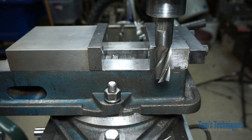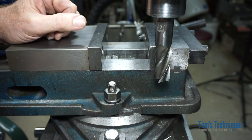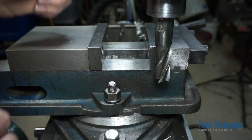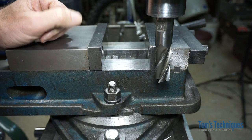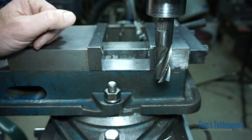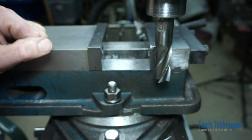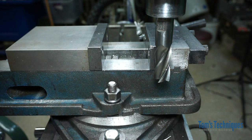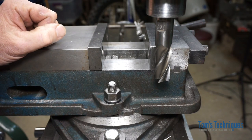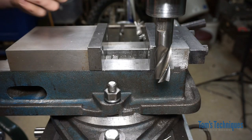Before we get started, let's talk about my setup. I'm using a seven-eighths diameter four-flute end mill, double end. As you can see, it's not gripped very well — I'm using a collet to hold it, and I don't have the proper holder for this size end mill. This end mill has a Weldon shank with a flat, meant for end mill holders with set screws. Normally the holder would come all the way down to the flute for a rigid setup, but in this case it's extending farther than it should. That's actually a good thing here, because it means it'll flex rather than break when I do some nasty things to it.